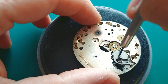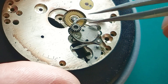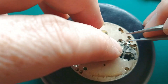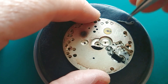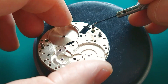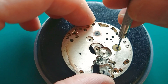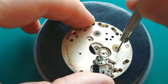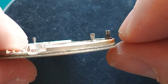This screw was quite loose, so it wasn't holding at all. I see there is oil but it's totally dry, so the movement hasn't seen service for quite a long time. This one has to stay because there is rust here — it seems that some water got inside, and therefore I couldn't unscrew this part. That's a shame.